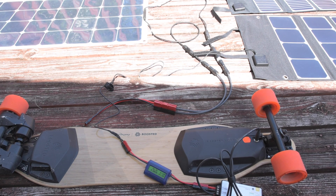Even though this is a 120-watt panel, it produces less power than my flexible 100-watt panel. At 58 watts, our boosted board has a 99-watt-hour battery. So 99 divided by 58 — this folding 120-watt panel should take 1.7 hours to charge up the boosted board from completely dead. From half-dead, it should only take about 50 minutes. So that's pretty good.